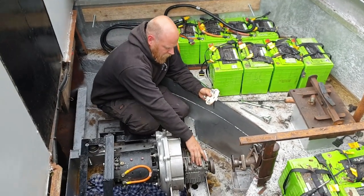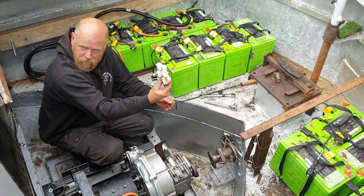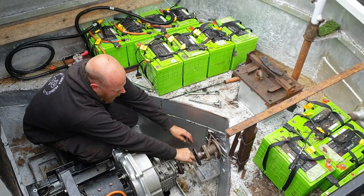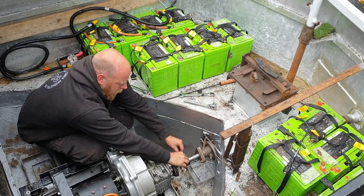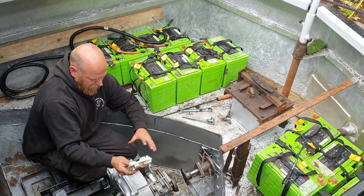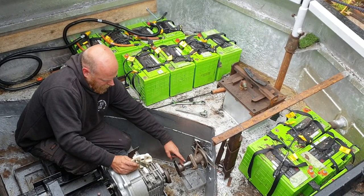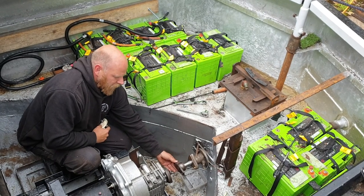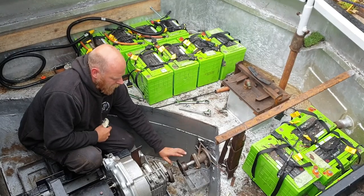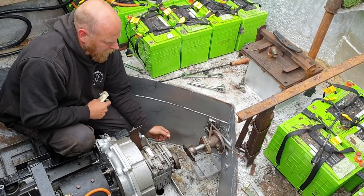So now the gearbox and the coupling on there, using the new coupling, the coupling that cost me money, now fits nicely in between there, so it connects up to the prop. What we have done is just a little bit of routine maintenance, really, nothing to do with fitting the system, but while we've got the opportunity, we took the coupling off there, new Woodruff key housing, new cotter pin, put that all back together so it's nice and firm and solid, not wobbling about anymore.